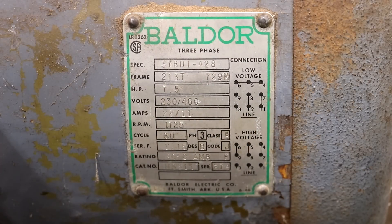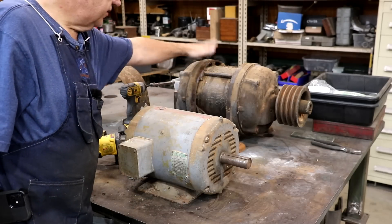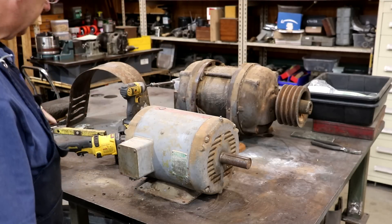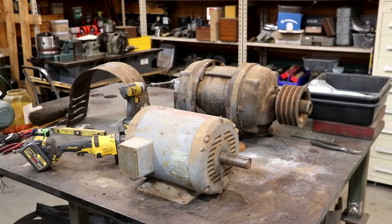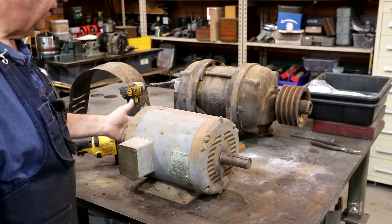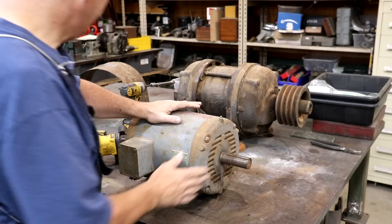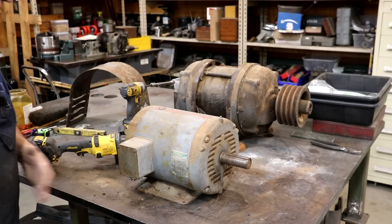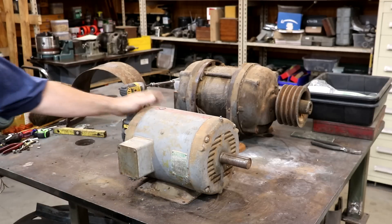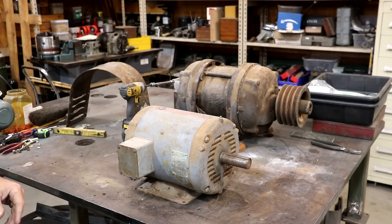This motor will do the trick — this is what we're going to use on the saw. I really liked the looks of that old motor, but I think we're just going to have to live with this one. I feel a lot more comfortable with it. I was told the person I got this from had recently replaced the bearings. I'm not going to worry about bearings — I think it's in pretty good shape. I want to get it cleaned up with a wire wheel on the angle grinder, knock out any rust, get as much old paint off as we can, and shoot it with some dark gray paint.